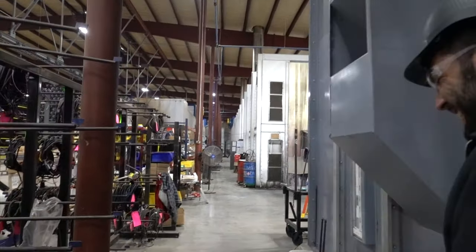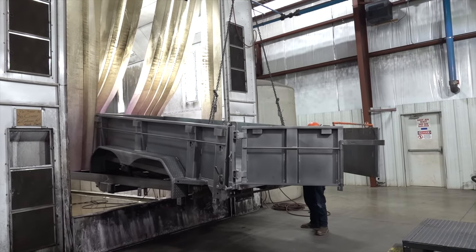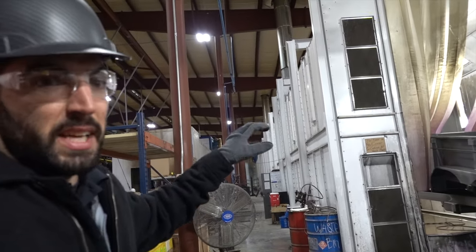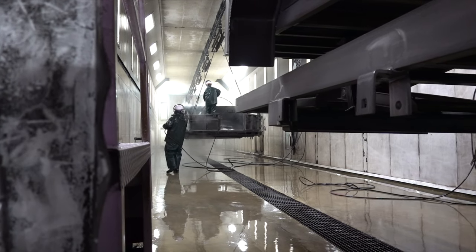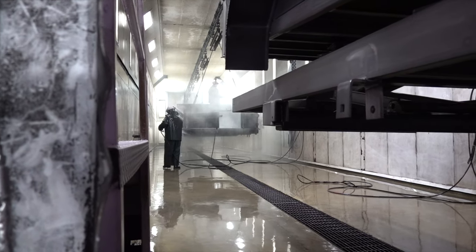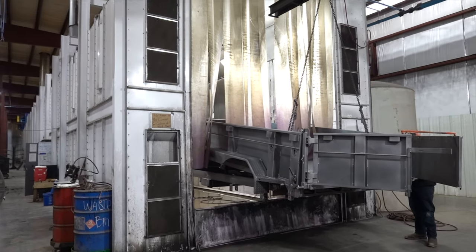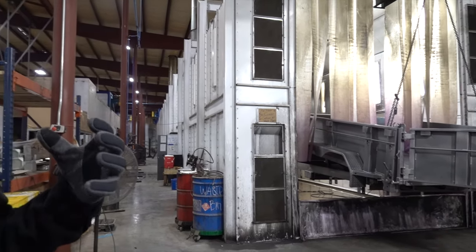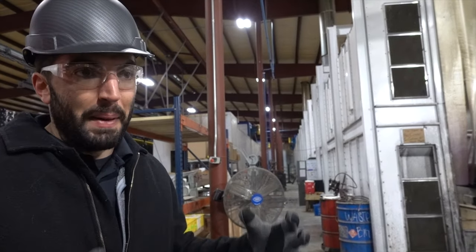That's mint. So our next stop is the wash bay. All of those things I was telling you about, the steel shot loosening up, well, the next important step is getting it all rinsed off, washed off. There's five different solutions. There's pH balancers, there's adhesion promoters, there's acid wash. All of that is done in this white booth. What that's doing is getting the material perfectly primed for the first coat of primer to bite into the metal.